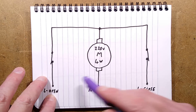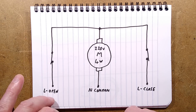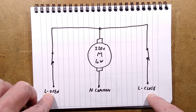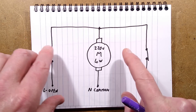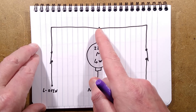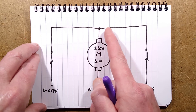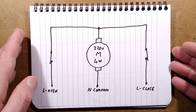It's worth mentioning that during operation, the connection not being used is actually live, so I need to be careful because the unconnected wire will become live. To get a change of direction, you disconnect 'open' and connect 'close' to move it to the other position. The motor is stalled against that position so it can go in the other direction. If it's in the mid position it will run in a random direction - it might go straight to closed, or go to fully open, hit the end-of-travel limit, reverse, and then come back. If you power both connections simultaneously it will just go backwards and forwards continually.